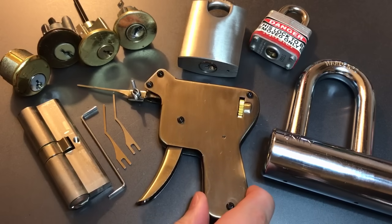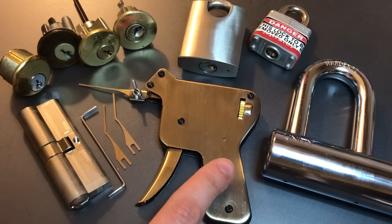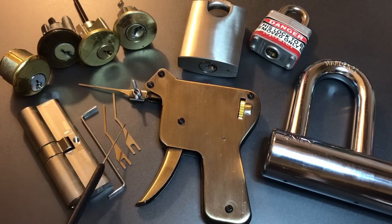As far as impressions on the tool itself, it's certainly made out of relatively thick steel, not at all flimsy. One thing I noted is that on the Banggood.com website there are a number of markings stamped into the body of the pick gun, and what I would have liked to have seen was some indication of which way to turn the little knob to increase or decrease the impact force. You'll be able to figure that out easily enough, but it would have been nice. You also get three blades for the pick gun — one straight and two angled blades. They're a little bit on the flimsy side, only about 20 thousandths of an inch thick and maybe 50 to 55 thousandths wide, so you're not going to get a lot of strength out of these no matter what they're made of.